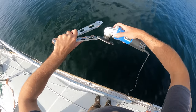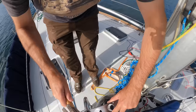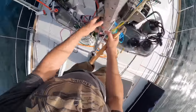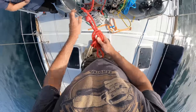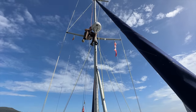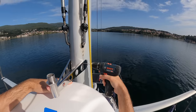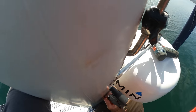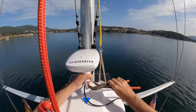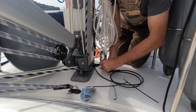After having made a few adjustments with the angle grinder, checked those adjustments and made yet more tiny adjustments, I finally had a mount that was a good snug fit. Then it was time to go up the mast. After much huffing and puffing from Ava, I found my little perch on the bottom spreaders. I drilled 3 holes on each side of the mast and got the mount secured with 6 rivets. I threaded the MSC10 onto the mount and secured it in place with the little locking nut. Then it was just a matter of running the NMEA 2000 cable inside of the mast.